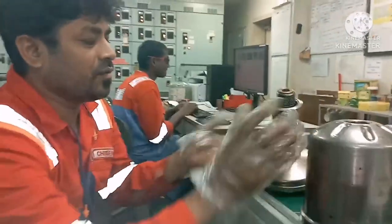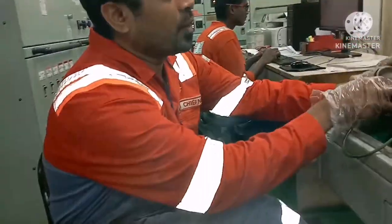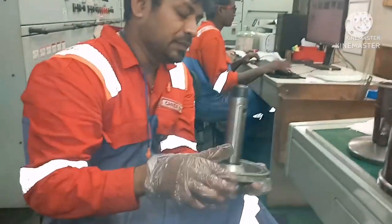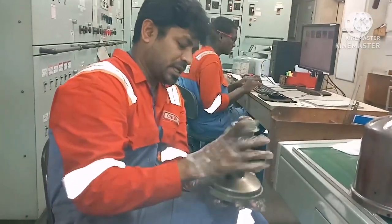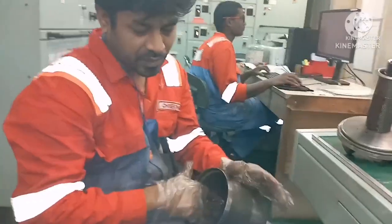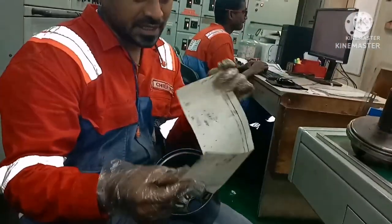The main things to keep in mind when assembling: check the nozzles, and check the O-ring — it should be in very good condition. For boxing up, always use grease or an anti-corrosive compound; I'm using copper slip. The purpose of this O-ring is to prevent oil from escaping the wrong way. Before replacing the cover, put a gasket — a plain sheet — over it.